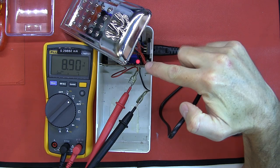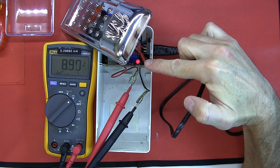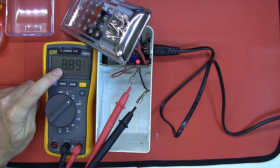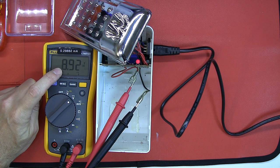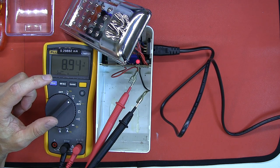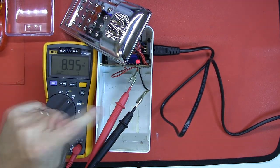Connecting the mains — I heard the click, so there's a little relay in there. The red LED has come on to indicate charging, and it's supplying close to 9 volts. So I need enough hybrid or super capacitors together to handle that — the hybrid ones I have are rated at about 2.3V. I'll get a few together and see if we can hook them in there.